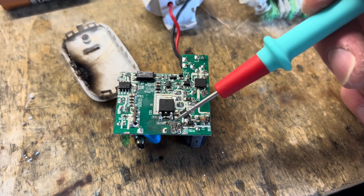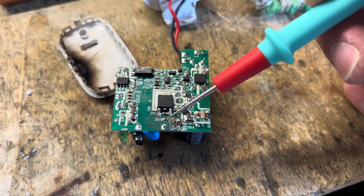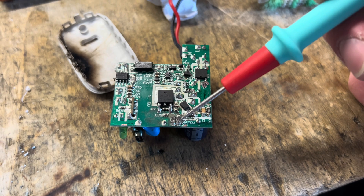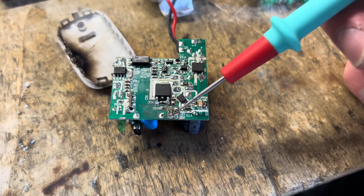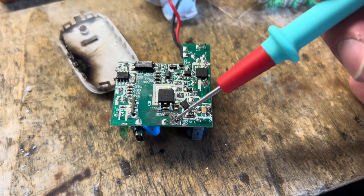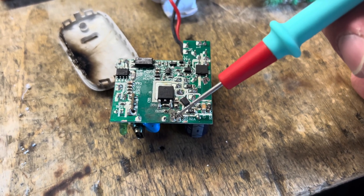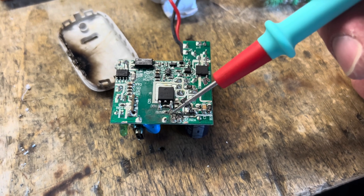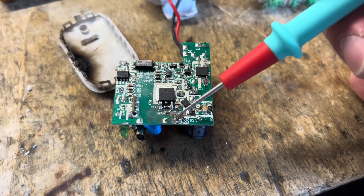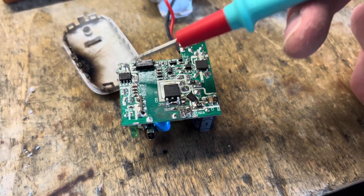It's basically sputtering. And this goes to the main switching transistor, which is completely shorted. What I would have expected was these two resistors to just go open without destroying the entire PCB. The first failure mode is that these resistors are not adequate, or they just did nothing to prevent the PCB copper layer from turning into vapor, which is not a good thing. Those should be here for protection. This went short and this went short because the secondary is shorted.